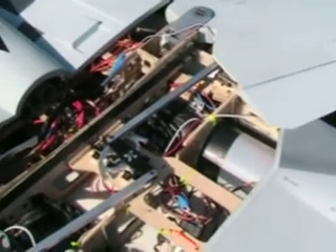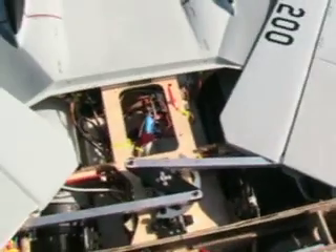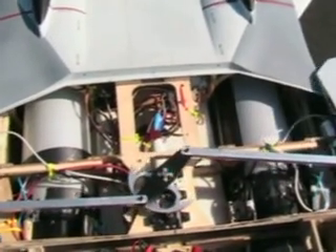There it goes. I have it hooked up to my flap switch. So when I sweep the wings, you can see my horizontal stab actually adjusts the pitch. My first attempt at doing that worked really well — the pitch changes were minimal, with a little bit of pitch increase. As the wing sweeps, I get a little increased elevator, and that works just fine. There's mid-sweep. There's full forward. So that's the wing sweep.